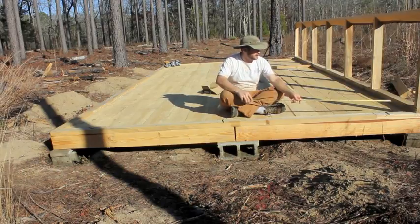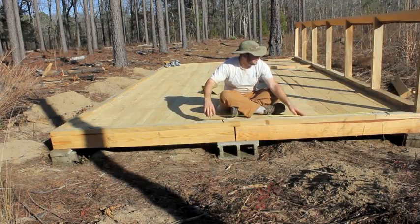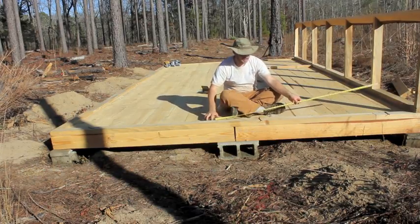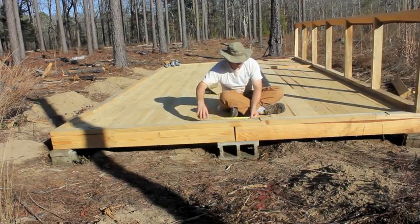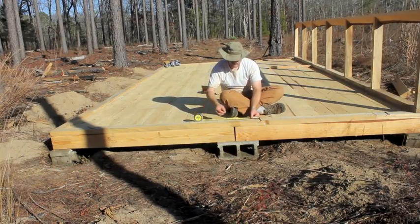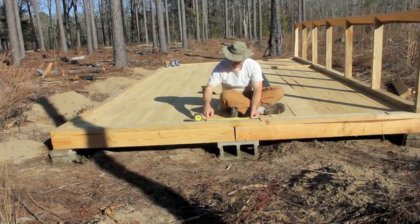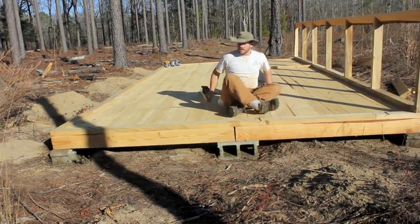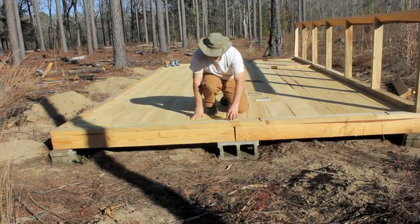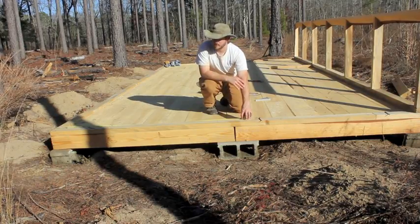So I don't know if you can see, I've got a stick right there at 10 inches. And then behind that, all I really need is about 4 feet. The 4 foot mark is right here. Now behind that, I need about 10 inches for the fan, probably less really, but I'm just going to assume that it's 10 for now. And then behind that, I need a 10-inch area for dead space between the fans and the back wall. So that gives me over 5 feet of space behind this kiln.